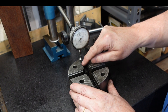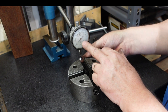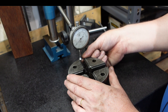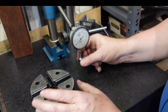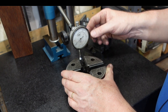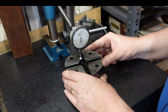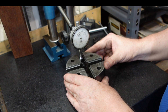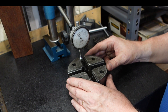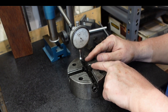The next thing I want to do is actually see what these surfaces are like. I've got a dial indicator here — this is actually a tenths indicator so it's relatively precise. I've got a big elephant's foot on it. One thing you need to watch with these is if you're just using the edge they can unscrew, so you need to watch for that. I'll put that on the surface and run it through — it's not moving an enormous amount. Right towards the ends where we've got some of that damage, but for most of it it's staying pretty flat — within a thou.